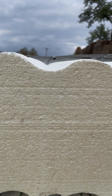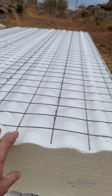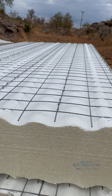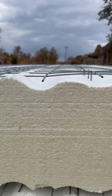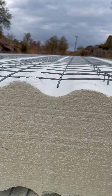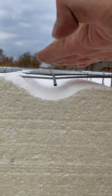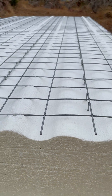These are skip panels and you see these waves in the foam with this matrix of wire mesh on both sides. It's all welded together and what happens is we use these to build the walls. This foam ends up inside of your walls and we spray a high strength structural mortar on both sides of the wall panel. So you'll basically have about two inches of structural mortar from the foam to the outside edge, and all this wire mesh will be encapsulated in that structural mortar, and that creates little micro columns.